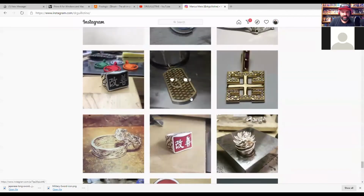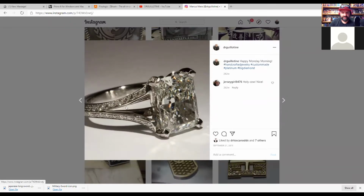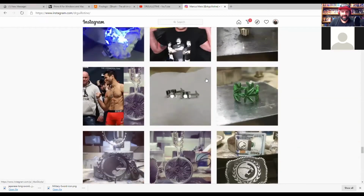So those are the kind of things that we're going to discuss as well over the course of some strategies in jewelry manufacturing and production. Adding metal for polishing. Here's another view of that ring. So here you see inside was nice and polished and shiny. The reason being is because it was separated and polished and then assembled. If you were to 3D print this in one piece and then cast it and try to clean it, you wouldn't have the same results. It'd be very difficult to get inside there and polish it really nicely. So you kind of want to use handmade techniques when using 3D technology in order to produce jewelry pieces. You really want to think about how you would do it by hand, make the components as Lego blocks, and then assemble them by hand.